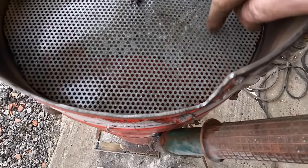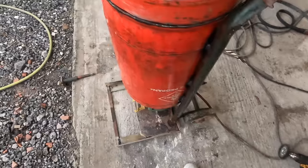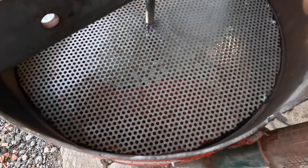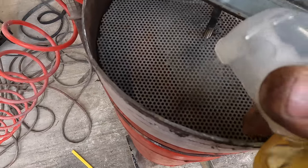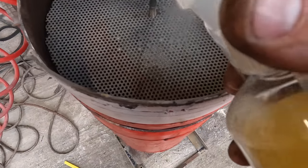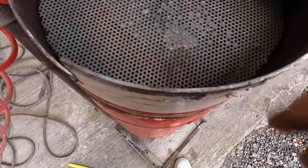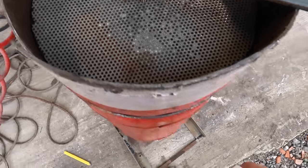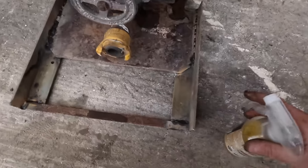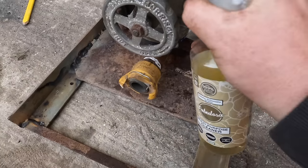Might be there were a bit of a burr left over on the cutting edge, or it might need some softer rubber putting on top instead of that rubber, because it's a bit hard. It is leaking, it's leaking that screw hole as well, that bolt hole. Better rubber is required on that. Oh, this is leaking here, look. That's that joint there.